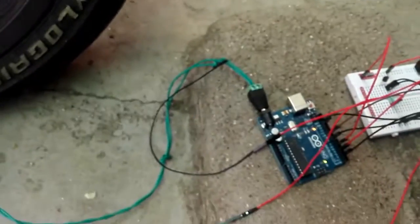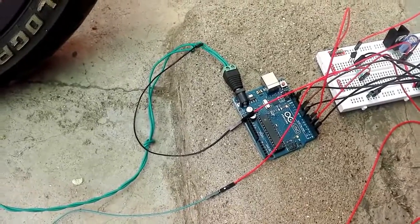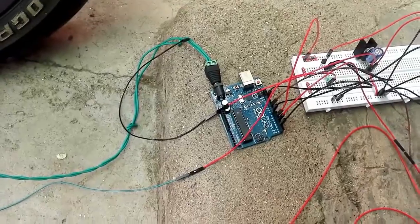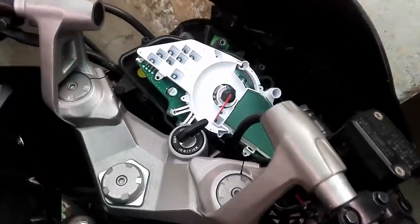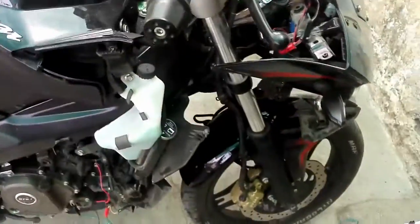I also need to modify the code for the RPM. My plan is to set it up to 1.5 — default should be 1.5 — and then the LED will light up at 1k, 2k, 3k, 4k, 5k, 6k, 7k, 8k, 9k, and up to 13k, because we have 13 digits on that tachometer. Yeah, we are successful guys — thanks for watching the video!